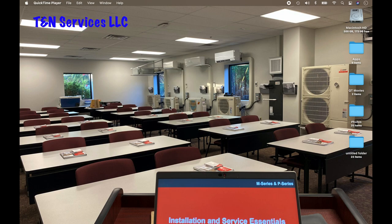This end unit right here is a P series heat pump attached to a four-way cassette. The second one from the end is a MUZ-GL — I think it's a 12 — the MUZ-GL12. It's a one-to-one, so one outdoor unit, one indoor unit, and it only attaches to a wall mount. This is our most common unit — it's the one that's like 21 SEER or whatever, we can look that up in the submittal.